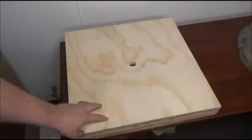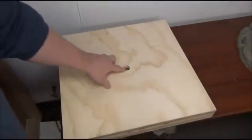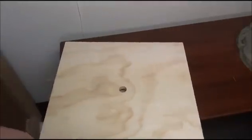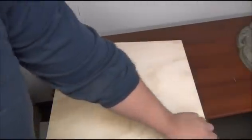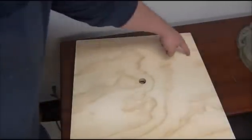We want this to be a sealed box, as airtight as possible. By box, what we mean is we have a top surface, a bottom surface, and then a hollow chamber on the inside. When constructing the box, we want to make sure we leave a chamber on the inside for the vacuum to distribute throughout. If we were to open this box up, we would see four sidewalls about an inch thick all the way around, then a baffle running through — not connecting to the outside wall — because we want the vacuum to be able to distribute throughout.